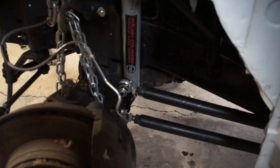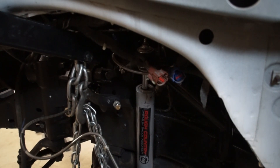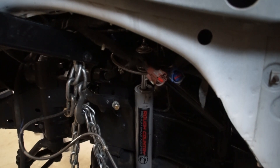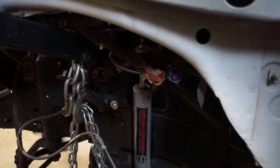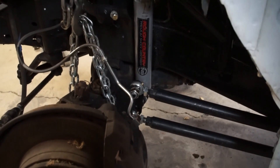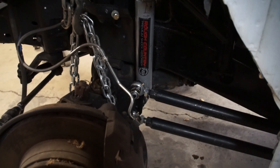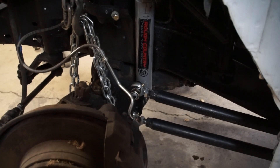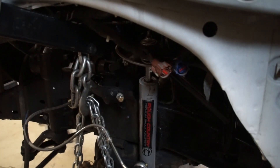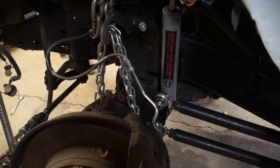The chain's loose — that's full droop. Top of that to some arbitrary point on the chassis: 36 inches. Now let's see what full bump looks like. I pulled the spring out so I didn't have to jack all this weight up and compress the spring at the same time — a lot safer. The difference between the two measurements was 14 inches. So I've got 14 inches of suspension travel as a worst case. I still have a couple inches of shock sticking out, and that couple inches would translate to three or four more inches of travel, so I could maybe be all the way up at 18 inches. However, the shock is running into the mount slightly, so that's something I need to look at — maybe some spacers or grinding down the mount a little.